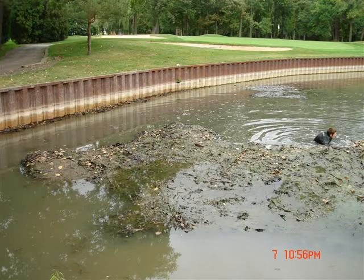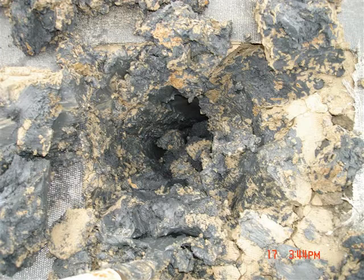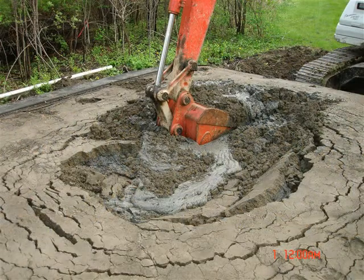They are a mix of coarse and fine organic soil type materials that pack together and form what is known as cake mass. This cake mass is slowly silting in the system, and more importantly, will actually act as a filter, giving you an illusion that your system is fine because it is pumping clear and clean water, which may not be the case at all.